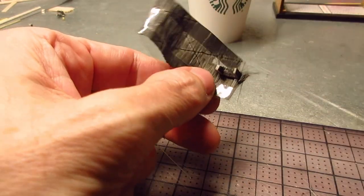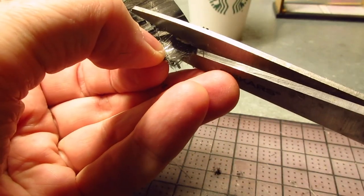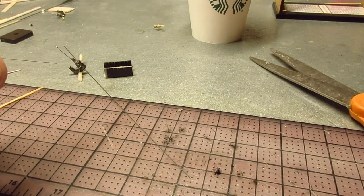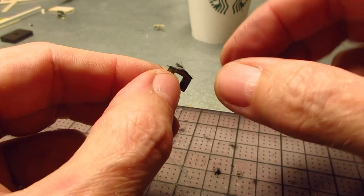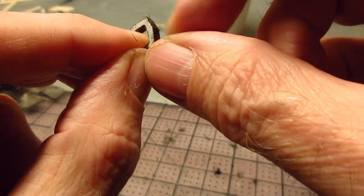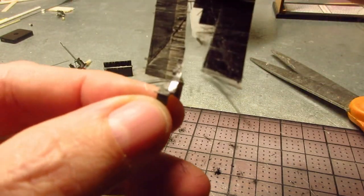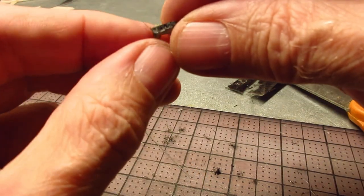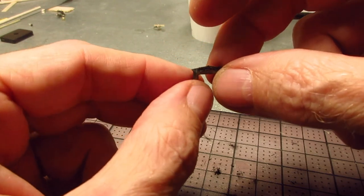After the other side dried, I get a pair of scissors and cut the carbon fiber close. Then it comes right off — there will be plastic on it but you can just peel it right off. Then I'll just trim it a little and sand it a little bit. This makes it nice and strong. The last thing you've got to do is soak it with CA.